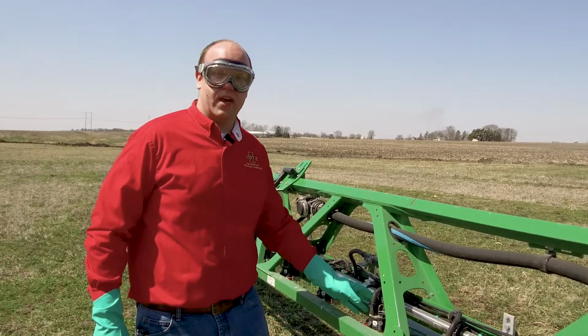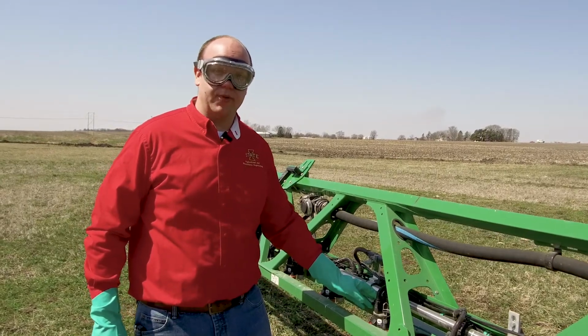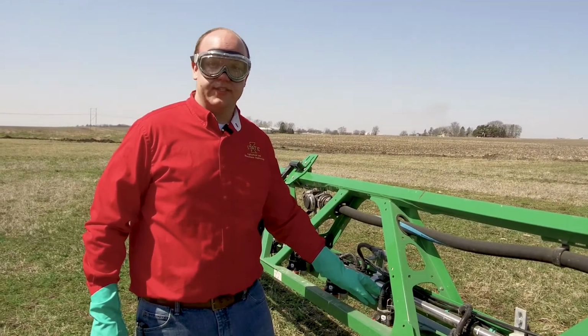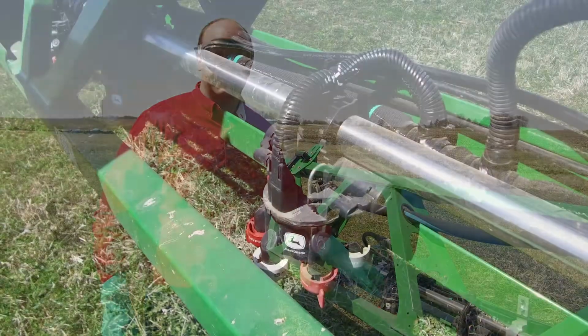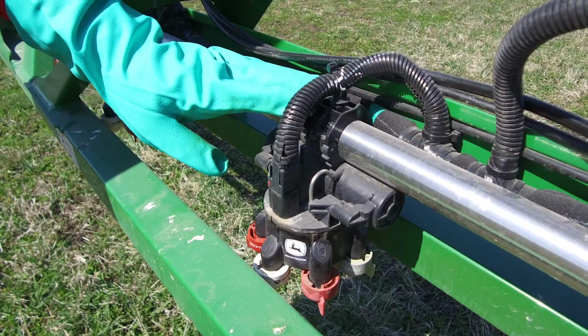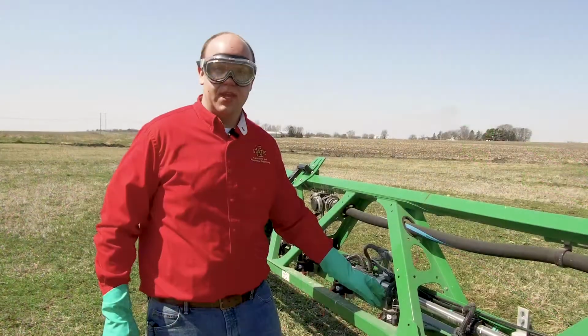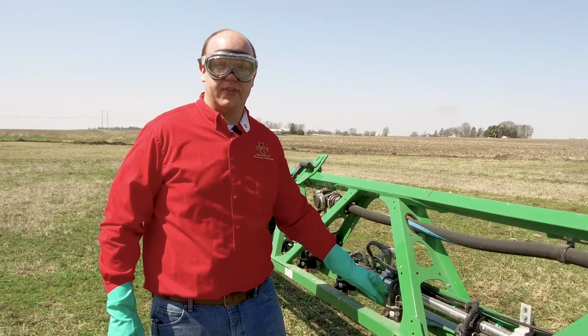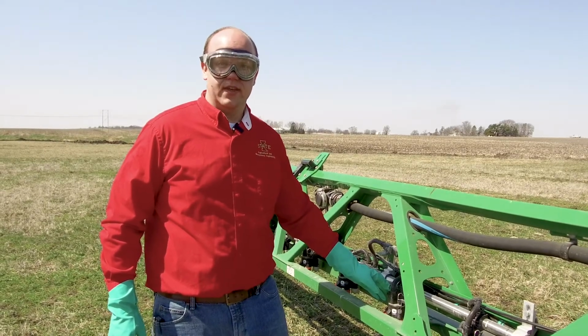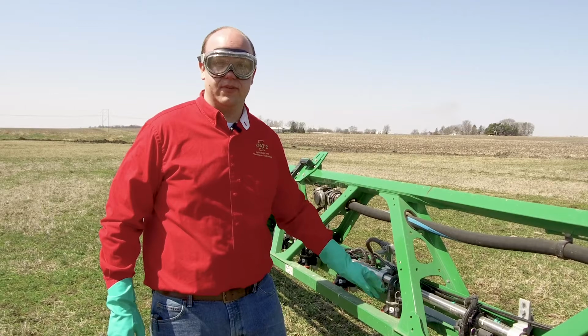You should also check the nozzles on your machine to ensure that they're properly secured to the machine plumbing. This ensures that all your tips are in the correct orientation and angle to each other to ensure the optimal spray pattern as you're applying product with the machine. This is especially important out towards the ends of the boom, where it might frequently contact the ground, fence lines, or trees as you're outlining the borders of a field.